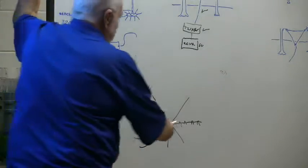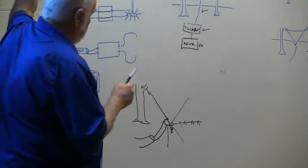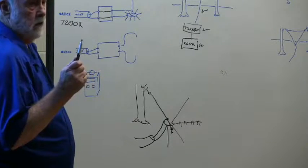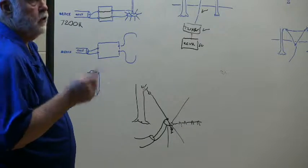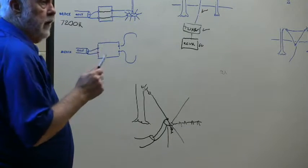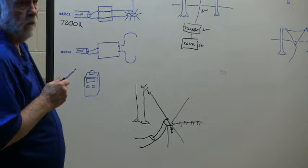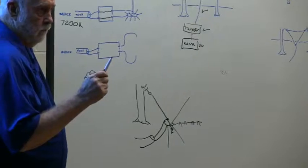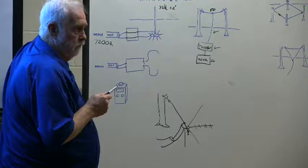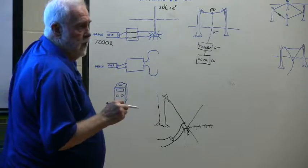But if one does come loose and you're mowing, it can ruin your whole day. So the best way to do it is exactly what the broadcast stations do: bury it. Now, if you're going to bury it, and that's preferable, that's the way I do mine, don't bury it deep. Deeper is not better. Don't go more than an inch to an inch and a half deep. You will destroy the purpose of the radial. An inch to an inch and a half is optimal.